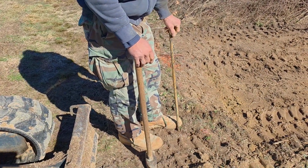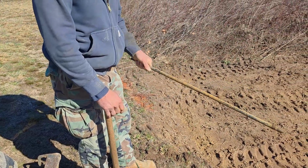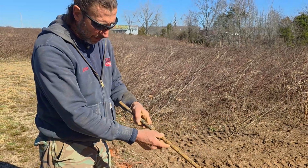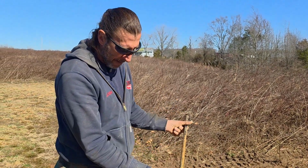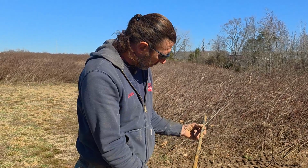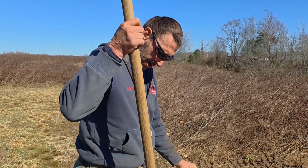And you've got some of these metal stakes that you already use for forms, don't you? Yeah, these are metal formwork stakes, or curb pins, people call them. They're pre-drilled with holes. They're a mild steel, pretty easy to bend. Pretty typical concrete formwork tool. That and my old trusty sledgehammer, and a good tape measure is about all you need.